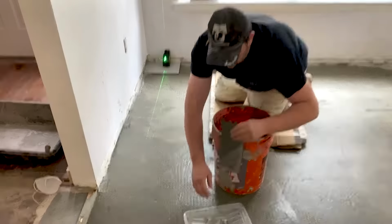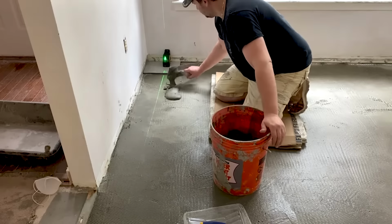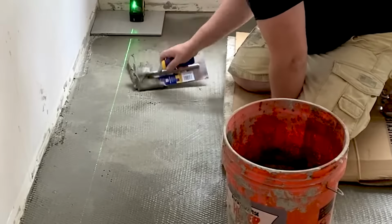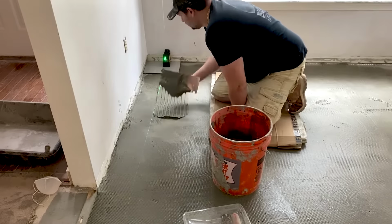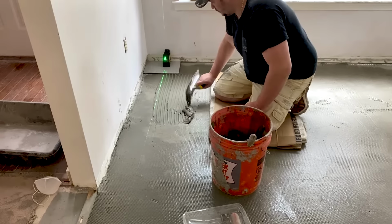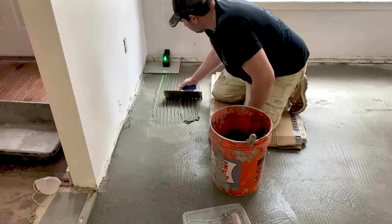Another important tip is to always use the type of trowel recommended on the mortar bag. Spread a 1/4 inch coat on the surface of the install area using the flat side of the trowel. Next, use the notch side of the trowel to comb the mortar into standing ridges by holding the trowel at a 45-degree angle. Then remove excess mortar, leaving a uniform ridge setting bed.